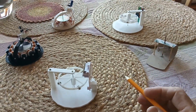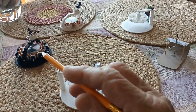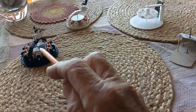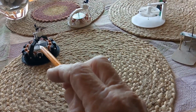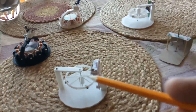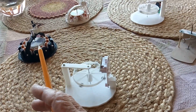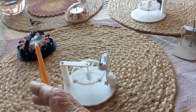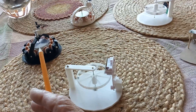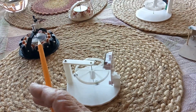I've turned my attention on these little motor projects to the bearing issue. When I built this easy spin here, I went ahead and bought the correct sapphire jewel bearings for it, and it really does make a difference from other bearing things I've tried over the years. The one that worked the best is a sapphire jewel bearing running on a steel needle. There's another bearing on the bottom — a V-shaped sapphire — you get it at Swiss Jewel Company online.